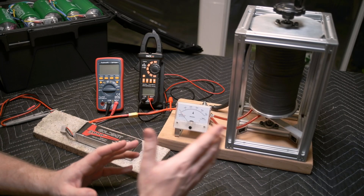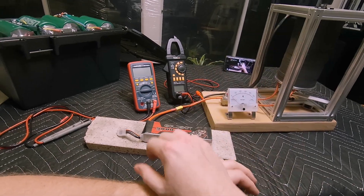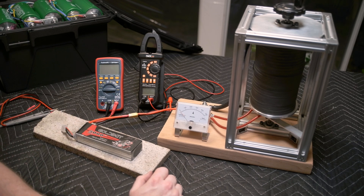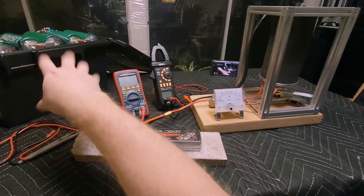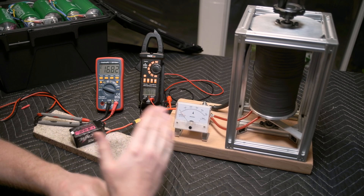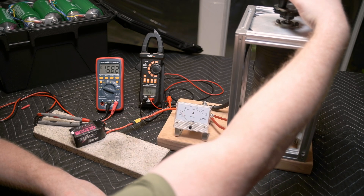Meet my 7,000-amp load tester. I've taken some of the graphite disks out since we're only measuring 150 amps — I've only got a 500-amp shunt with a 500-amp meter right now. One meter will take voltage right off the balance lead, measuring right inside the battery itself, and the other will take voltage right on the other side of the XT60 connector. We're going to test for five seconds at 150 amps. You don't want to take any one cell under 3 volts — three times four is 12 volts — so if we see 12 volts on that meter, we're in the realm of damaging the cells.